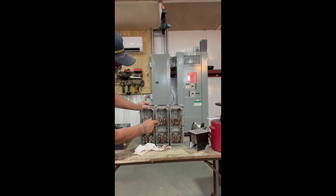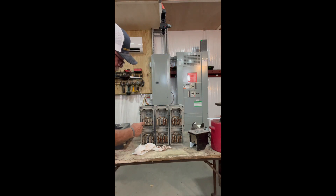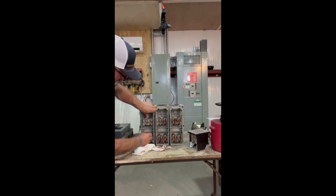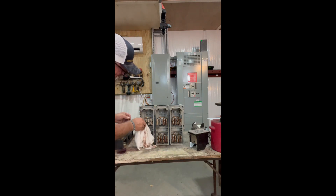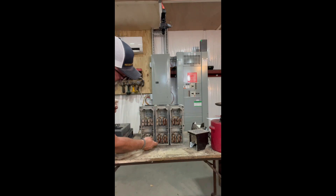You can see how that's a little more silver again — I would hit that with scotch brite just to show you the difference. Because this is a movable fixture where it goes into the stab inside the substructure, you want to make sure it's clean. It could become a hot spot if not addressed during maintenance. Clean it off with the alcohol — floss in between there — make sure that's all clean, then repeat that process on each one all the way across A, B, and C phase.